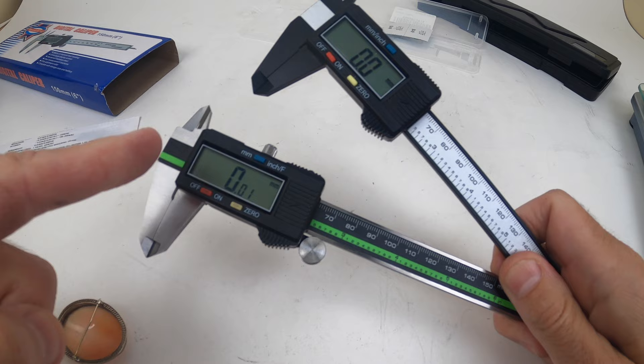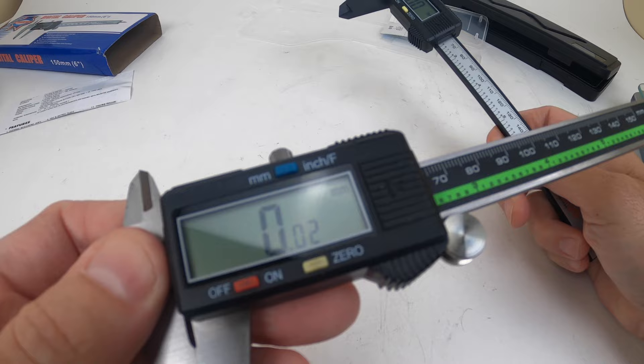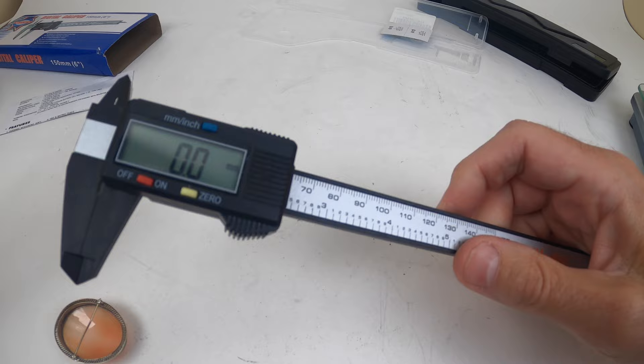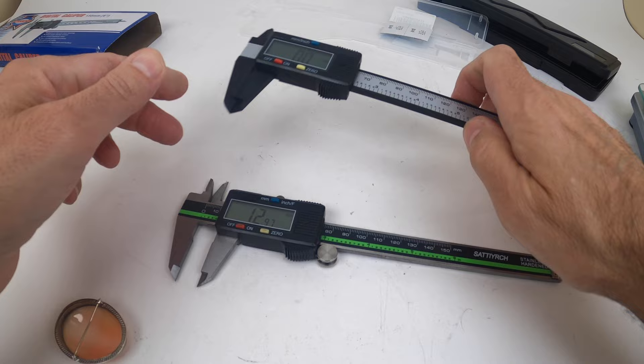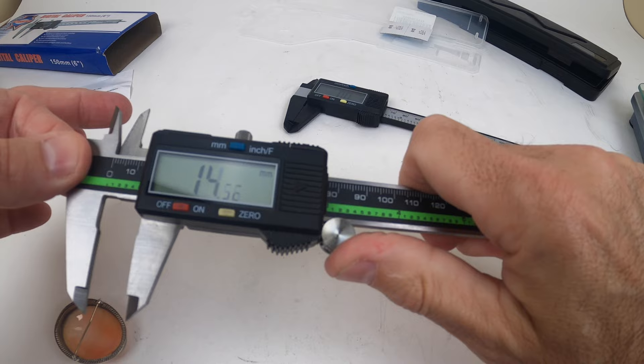If you have any questions or comments, I'll leave links down below for both of these so you can choose. If you're going to use a caliper all day, be aware the metal one is quite heavy — six ounces versus about two ounces for the plastic. I always believe in buying something a little better quality that lasts longer. The zero button works great on both, but I really like the roller thumb on the metal one — it's not on the plastic, and it helps you pinpoint measurements accurately. I'm returning the plastic one and keeping the metal one.